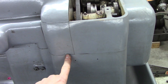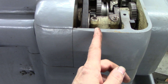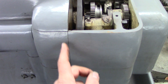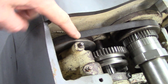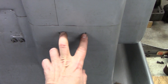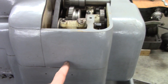What I was thinking of doing is this. This is a casting — this comes off, this comes off, this is separate. There's a parting line here and this comes off. I was thinking about cutting this straight down and taking this piece out — mill it out, finish it out with a milling machine. Then instead of the belt going to the spindle, I could have this belt come out here. And have a motor — put one, two, three, four bolts — and have a bracket with a rocker to create belt tension.